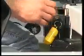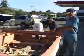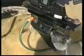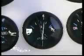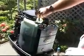Before operating any switches, check for fuel or LPG odors. Fix any faults immediately. Is the engine working properly? Test your outboard using a hose and freshwater cooling. Check fuel, oil, and also your coolant levels, if applicable.